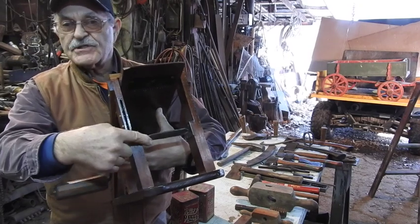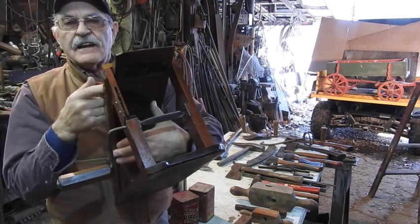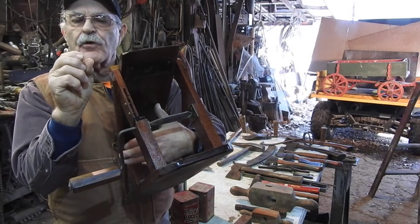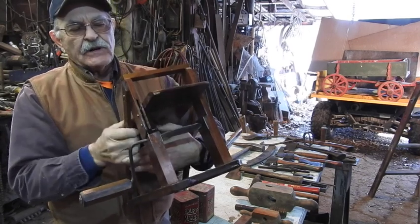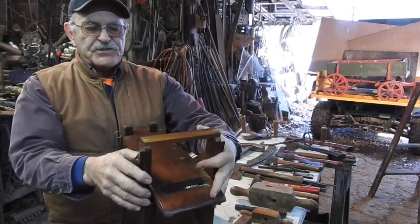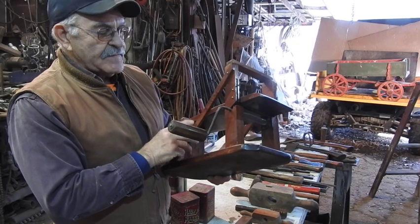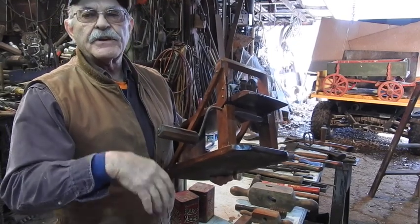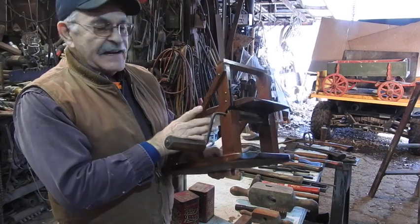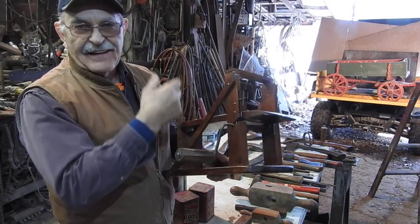What you do is pull your knife out right here — this knife comes out by pulling a pin. You slip a turnip onto the knife and stick it in. Up here you can see a bunch of knives — just short pieces of handsaw blade that he cut off and drove into little slots, grooves about 3/16ths or a quarter of an inch in width. You put a little pressure down on the top as you turn the crank over your crock. As you turn the crank, your turnip goes around and around, and it shoots the kraut curlings right out the top and down into your crock. This is one of two we found going through the material at the estate sale. My much older brother brought all the parts home and assembled this one from new old homemade stock, and assembled a second one for myself.